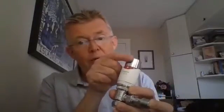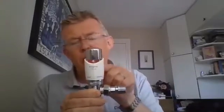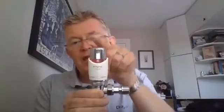It means more savings, basically, because the things they look at are speed, reaction time, how quickly it reacts to changes in temperature, and also how well the sensor here ignores the hot water in the valve. One of the problems of a TRV, of course, is it's mounted right next to a heat source, and you're sensing temperature here, but really you want to sense the temperature in the middle of the room. It's very important to have good flow rate around here, good airflow around here, so that you're sensing air temperature and not the water temperature in the valve. Poor TRVs, ones that score very badly, means as soon as this valve gets hot, the valve closes, which is no good at all. You're not sensing the room temperature properly. So this is the best product we have for performance.